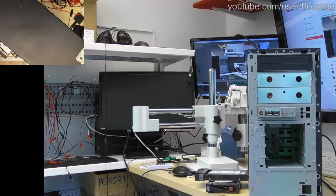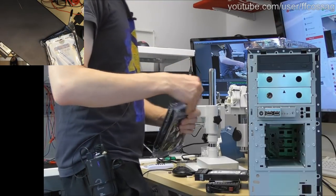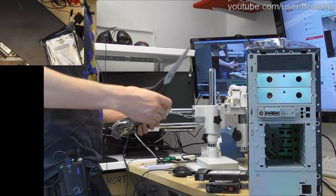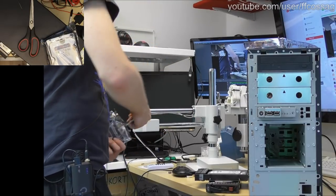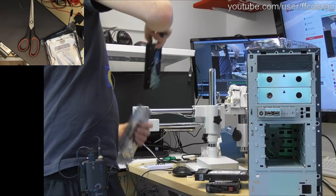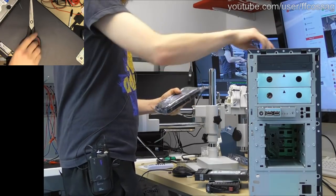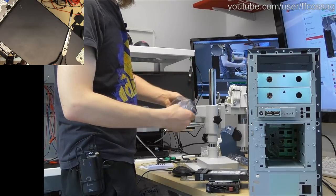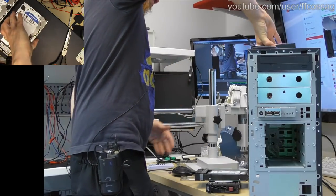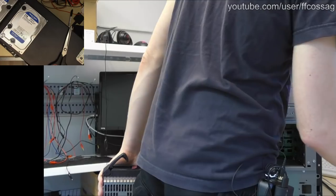My issue is the old LSI controllers that shipped in these can't use drives bigger than 2 terabytes. So if you try and shove something bigger in there, it's just going to cap it out at 2 terabytes, and you're screwed. You need a different controller in that case. That's why in these machines, often just putting your drives on the chipset controller is going to be a better experience, since you can actually use big drives on really old hardware.